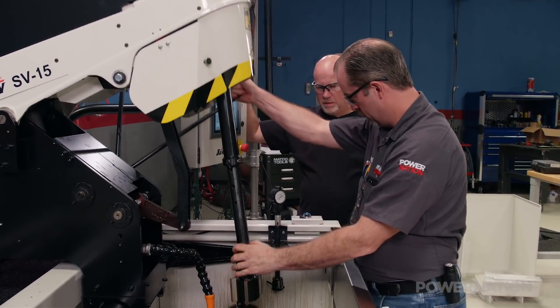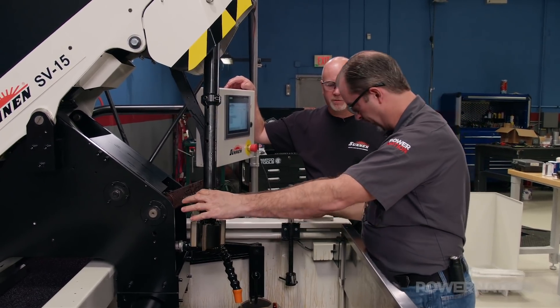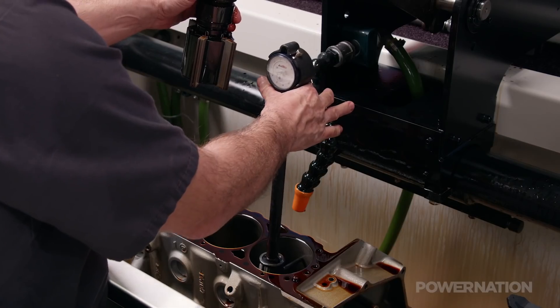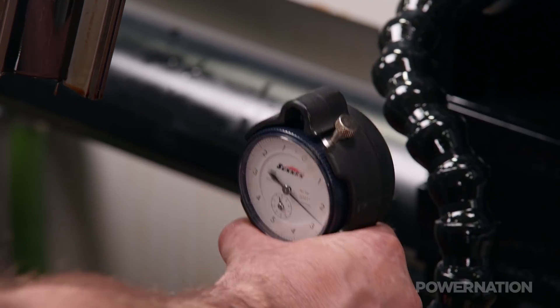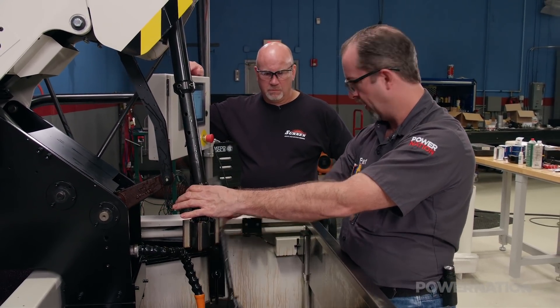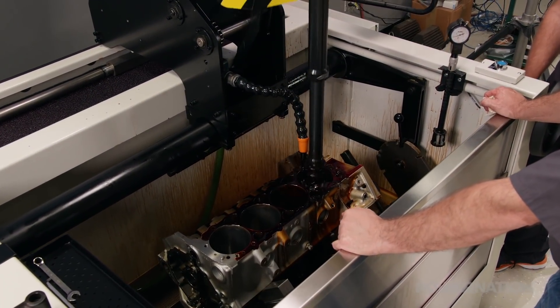All right, let's see where we ended up. Based on where we set our size, we can check the dial bore gauge now. We were at five thousandths out on a rough — let's see how close we are. Look at that. It is straight all the way down, almost right to the tenth. That is impressive. The automation really helps because it senses where it's tight and keeps it straight by auto dwelling.